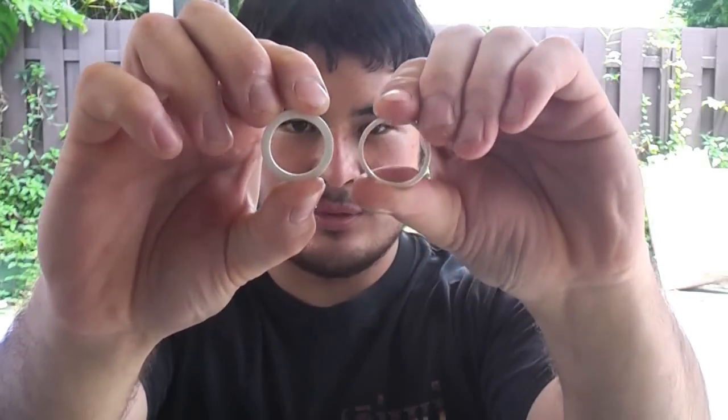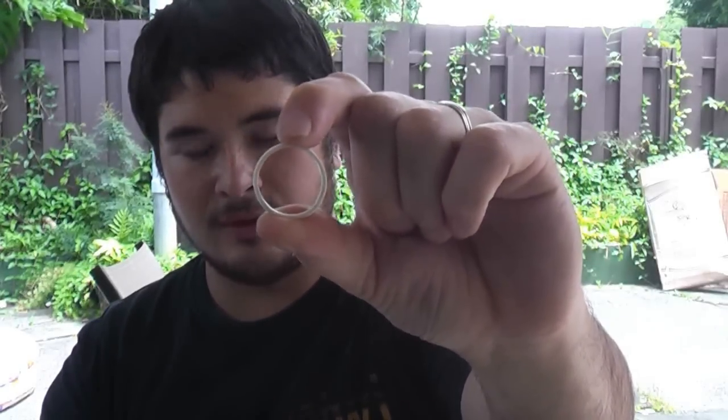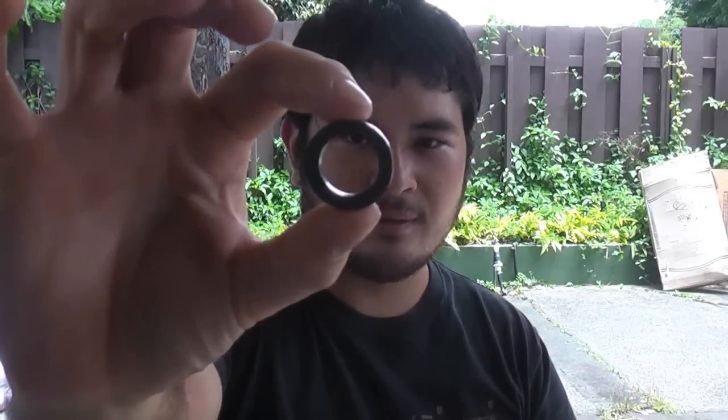Here you can see again — this is the thin wall pipe and this is the Schedule 40. The thin wall pipe is used a lot in cold water for sprinklers and things like this. From what I've been researching, this is similar to what most of my viewers in the UK or Australia have to work with as far as PVC goes. Most of the thicker pipes available there are of this type of material with stabilizers in it. There's nothing wrong with it — you could still use it, and it'd be safer than the SDR pipe, as that will probably snap or fold. Thanks for watching, and I'll see you guys later.